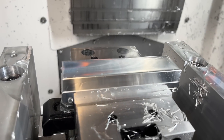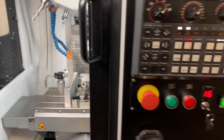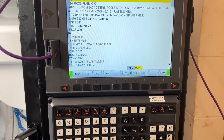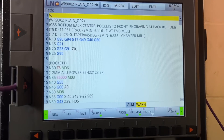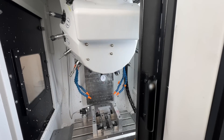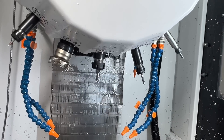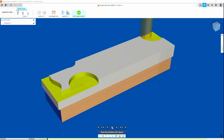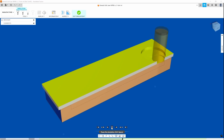These cutters might not be mirror finish but they're pretty good. The LNC6800 controller is pretty much based on a FANUC — there are a lot of similarities and compatibilities, but there are some significant differences which keep catching me out. Now the face of the front jaw is completed; next job is to machine the back, so I'll flip it over in the vice. Before I start, I'm having a closer look at why the CAM process is doing so much air cutting, but I haven't actually worked it out. No idea what I'm doing wrong.